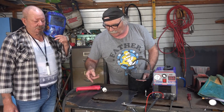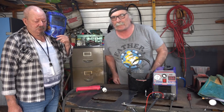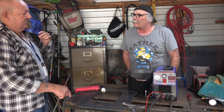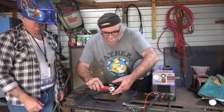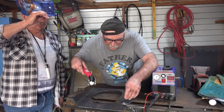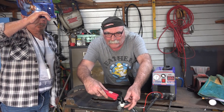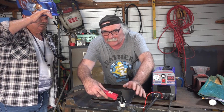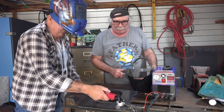We'll put the guide on so you don't have to hold it above the steel. You just drag it. The guide wheel needs about a half mil just above the steel so you're not dragging your tip on it. The theory is it makes it easier for newbies to use. Let's have a go and see if Barry can cut with this on. Remember your speed, Barry.